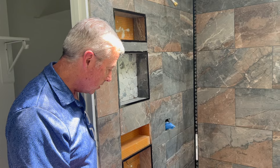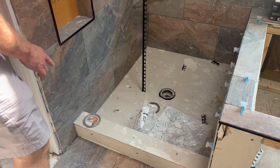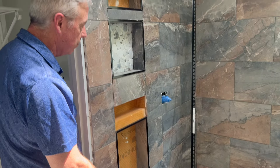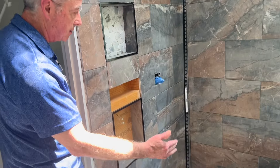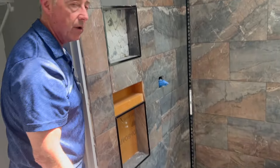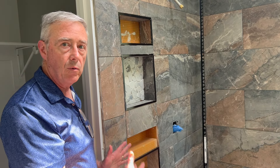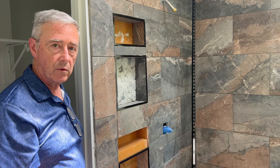He also said the drain wasn't right, and that waterproofing systems now need to be carried up inside the wall a certain distance — eight feet. They're going to have to phase it back into the tile grout joints to create a little bit of a tub, so it won't even meet what is currently required for tile construction for showers.